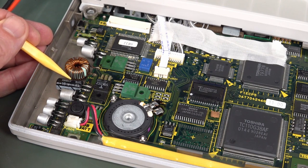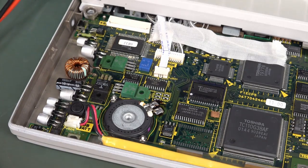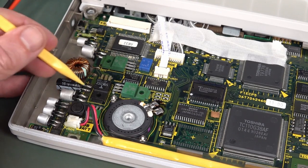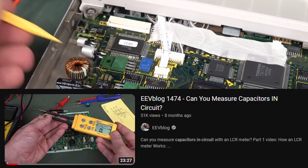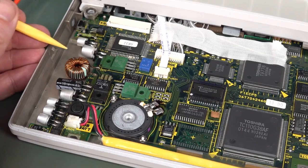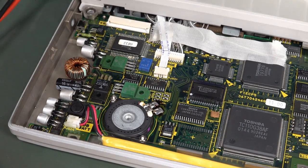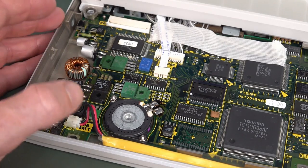These 30-plus-year-old electrolytics have a wet electrolyte inside - it dries out, or it could leak. Just 30 years - they can completely dry out. It's almost universal that you would recap old products like this as a matter of course. Because they were easy to measure in-circuit, I knew a couple looked dodgy. I did a video on measuring caps in circuit - I'll link that one in. And sure enough, all of those Elna brand ones verified as dodgy, so I took them out.